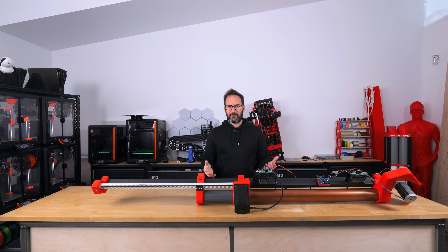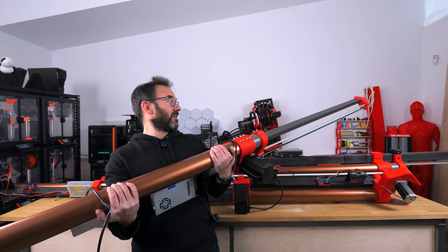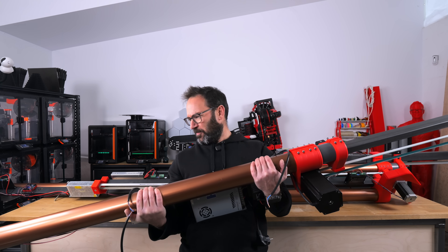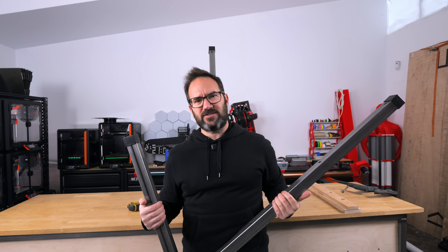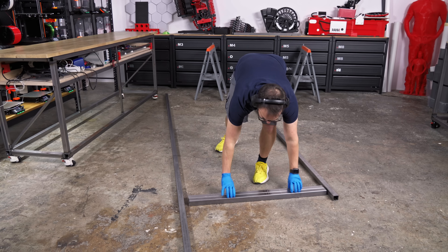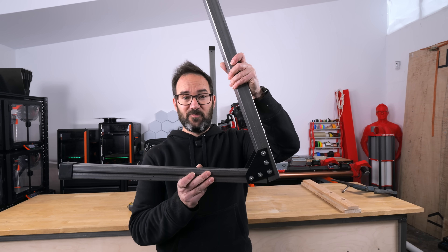If I reattach the pipe slapper and mount the required electronics, we have a complete unit. But one pipe won't cut it, so I made more — quite a few more. This is the longest one; it's very, very long. I can't just play this on the table — I need a frame. I made these squares that are exactly straight just for balance, and I'll attach all the pipes to them. I also designed a complete steel structure, cut everything to length and welded it, but somehow it wasn't straight so I had to scrap it. I'm pretty sure this completely temporary solution will work first try.